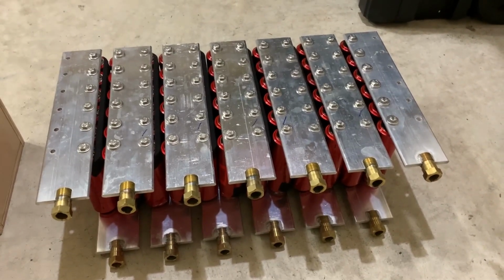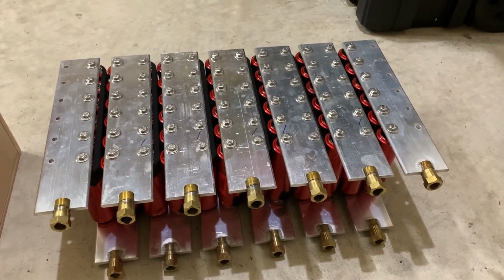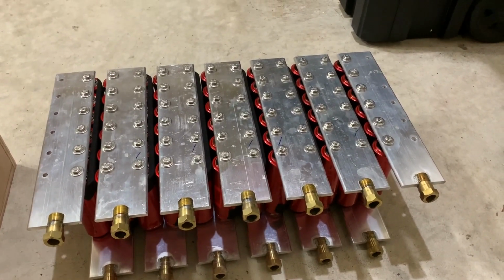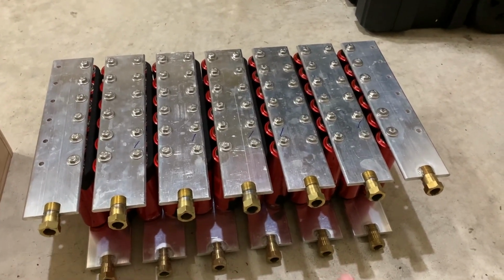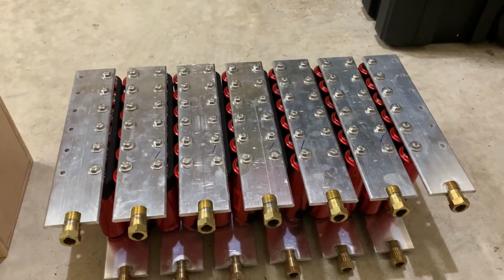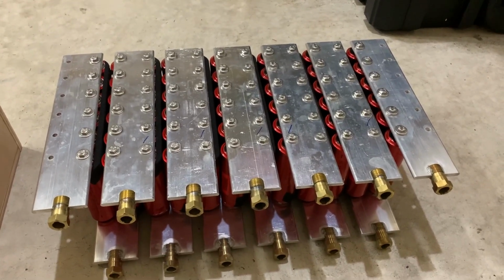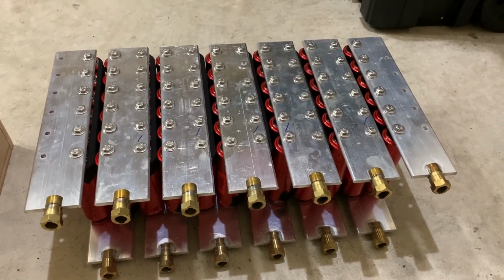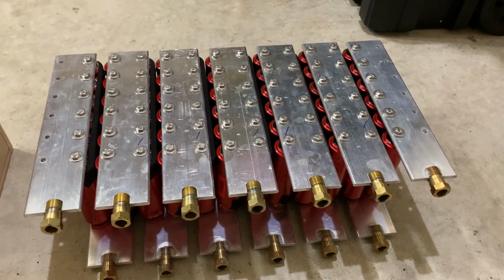Slight change of plans. I ended up doing a 12S 6P battery pack instead. So it's nominal 36-ish volts from end to end and 6 in parallel. So it should be more than enough voltage to run the Ready Welder spool gun at full power, and it should be useful for other things too, like running an inverter.